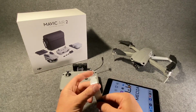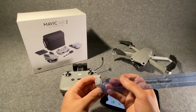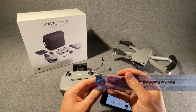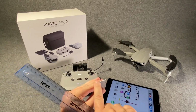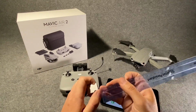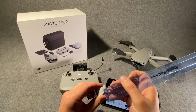The bar, measurement wise, as I said, is 20mm wide, it's 3mm thick. The holes here at the back, it's 14mm between edge to edge from here to here. As I said, chamfered with a Dremel tool at a particular angle, so it allows it to fit in between the bars. It's 7mm from the back edge here to the center of these grooves.